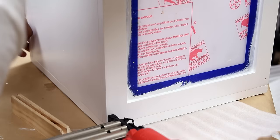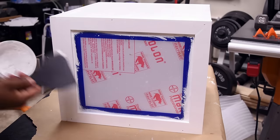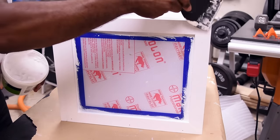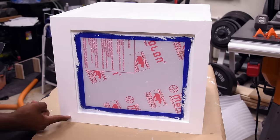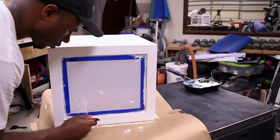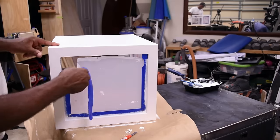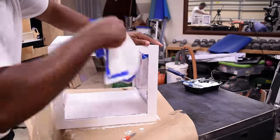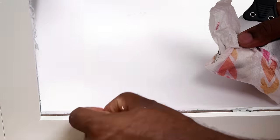Use a clamp to clamp the open end, then install more nails. I'll come back with some spackle to fill in the nail heads, sand that, and then put another layer of paint on it. When using masking tape during painting, the best way to remove it is to take a razor blade and score the corner first, then remove the tape — skipping this step increases your chances of peeling off the paint. If you don't press down the edge of the tape you'll get paint bleed-over, but with plexiglass you can easily remove it.